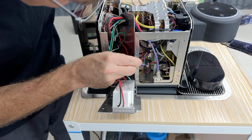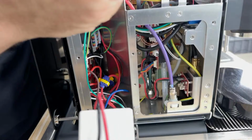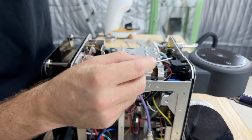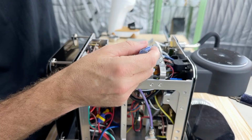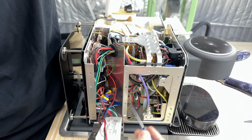This tube right here is doing something else. When you hit start on espresso, water circulates from over here, mixes here, gets temperature set for a few seconds. Because what actually happens is for your first espresso especially, some of this stuff is cooler and is cooling your water, and we don't ever want to make espresso with cool water. So when you hit start on the espresso machine, you'll hear it go chug chug for a second or two. And what's happening is it's rejecting water as being too cool, and it's sending it here back into the water tank. So it's essentially recirculating.